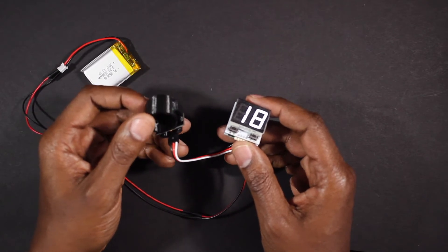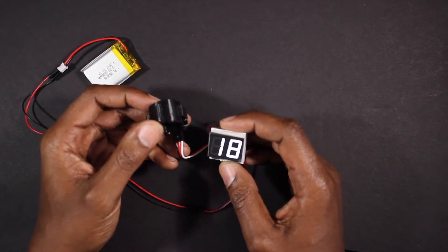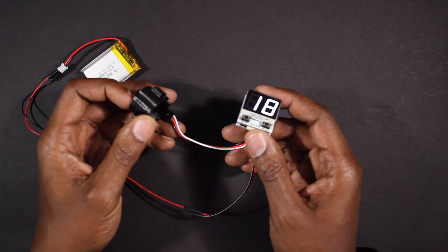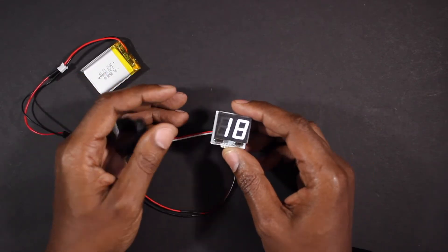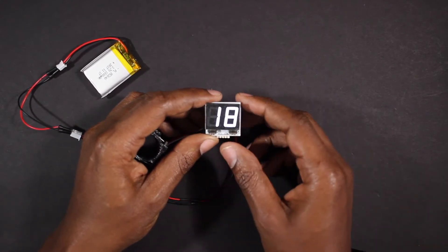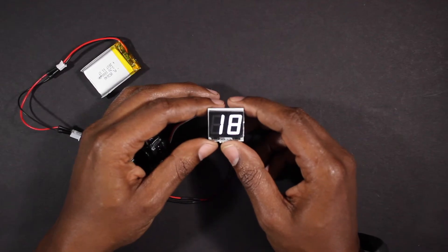The IR connector is the same 3-pin connector available in the v1 and v2 kits, which means it's possible to disconnect your current IR installation and attach it to this connector for an easy upgrade. This connector can also be modified to accept the fire switch once you change your settings in the advanced menu. The reset switch on the back can be wired to your blaster's clip safety switch to reset your counter when the clip is removed and unloaded.